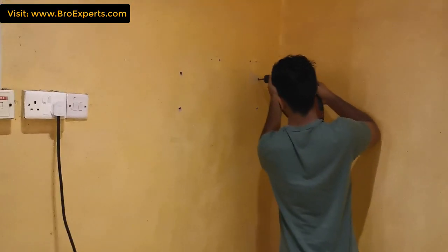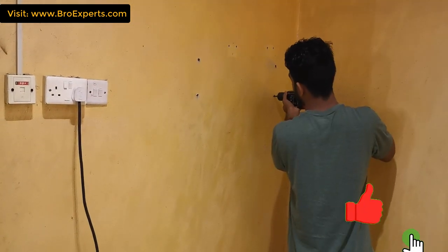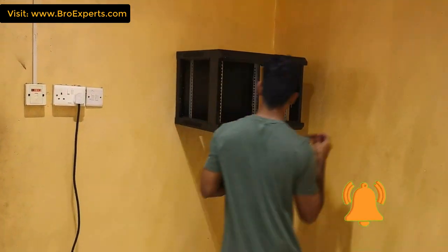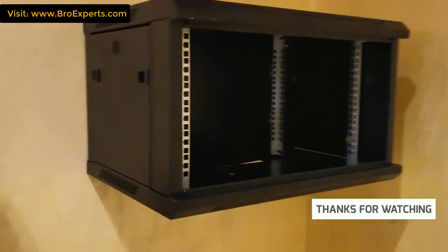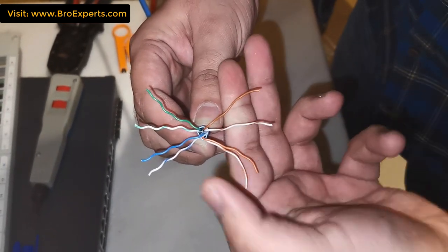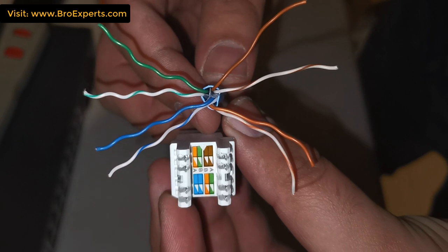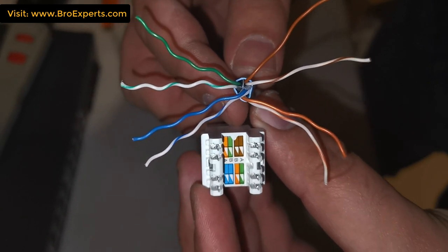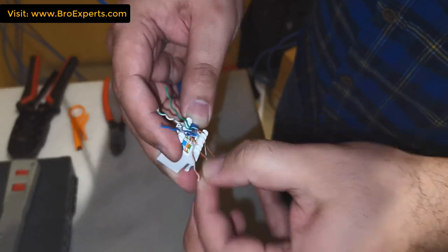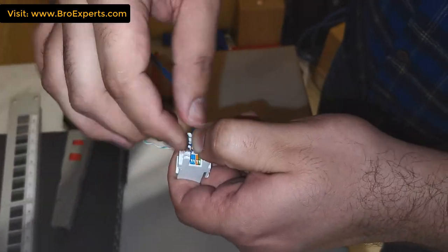Here you can see we are drilling to mount our network cabinet in this wall. Fixing is done with heavy anchor bolts. Now before pulling cables inside the network we should punch them. I'm going to use the 568B standard on keystone jacks — this color scheme is designed for better signal isolation and noise protection for newer networking systems.